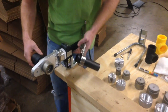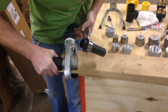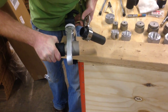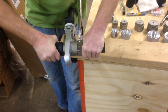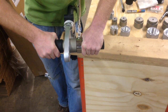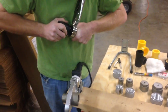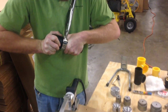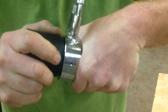The fitting can handle a little bit more heat than the pipe. First I'm going to push the coupling onto the male heating adapter slowly — it'll start melting as I'm pushing it on — and once I get close to the stop at full depth, I'll insert the pipe. The pipe is much easier to insert than the coupling. I'll count to 18 seconds, then pull them straight off and push the coupling straight up against the cold ring. It'll squish some excess resin between the fitting and the cold ring and make kind of a flat spot, which is what an inspector is going to want to see.